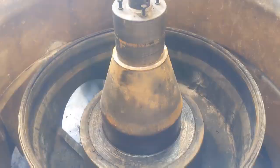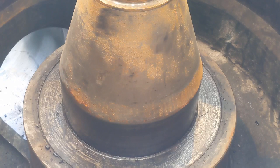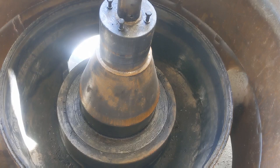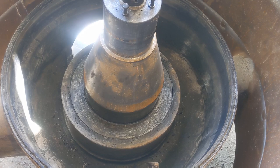Guys, today we've got a monster job. See the shaft here. It is approximately 18 inches diameter, and I have to cut it. So we'll cut across the top at the smaller diameter, since there's a small oil passageway. We'll aim to break into that to let the molten metal run away from us, and then wash down the side to the bigger diameter, and then work our way around.